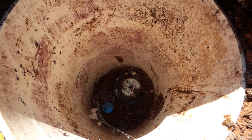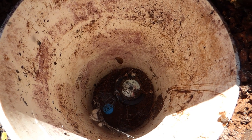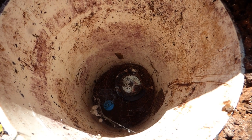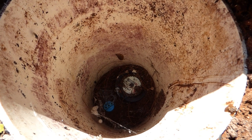You can see it's facing that way at the moment — just turn it half a turn and that's it off. For an ordinary stopcock it's the same as I showed you: just keep turning it until it's off, and then turn it back a quarter to half a turn to make sure it stays free. That way you've got your second protection lined up ready to go in case the main stopcock should fail.